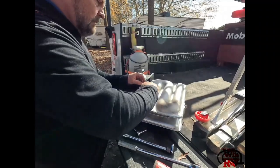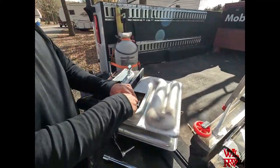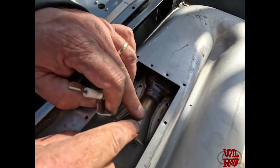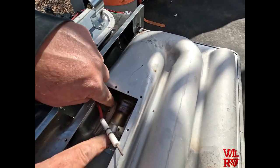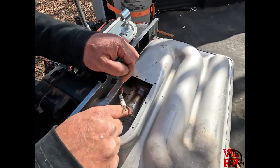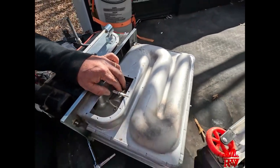All right, burner head's going back in. And if you can see here, I didn't know if you got any of this earlier, but just 2 screws right down here on the foot. 1 screw right there, and then the 2 screws that hold our electrode in. One of them is for the burner. Mm-hmm. And the way they've got that igniter, it's kind of dummy proof as far as the gap between it and the burner, but I've seen them where they're off.